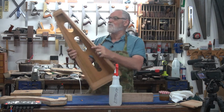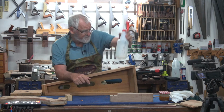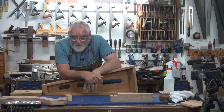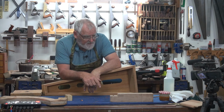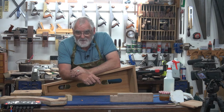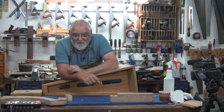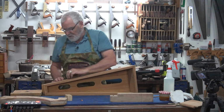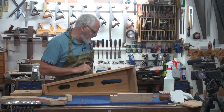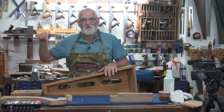Now, at the outset, I will say again, as I did in the description, the one I'm using is purpose-built. The maximum amperage output is about 30 milliamps. It'll give you a tingle, but if you've got a pacemaker, don't use it. There are a lot of people, I won't be disparaging, but there are a lot of people on the internet saying you can make these out of microwaves or out of other bits of electrical equipment. Yeah, they pump out about 50 amps, which will kill you dead on the spot. In fact, if you look up Lichtenberg machines on the net, there are lists and lists of people that have died doing what I'm doing. But I will stress, they're not using the machine I'm using.